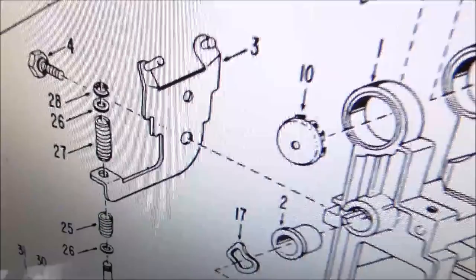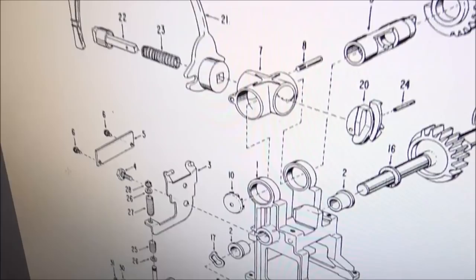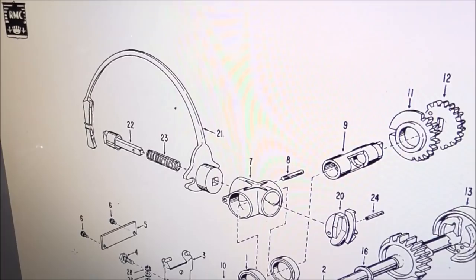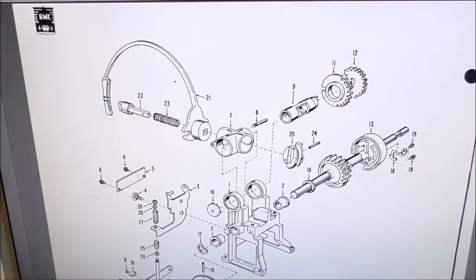It looked like more, but really, it's just the very top. Oh, and then we took the little housing here out. It's just the very top of it, just the gripper bow. You're not messing with the cam. The switches on the back of the cam go back here. You're not messing with any of that. You're not messing with any of this stuff here in the front. Just the gripper bow, because that's what gets gummed up. That's your problem. That needs to move precisely because of basically this piston going through it. That is the whole main problem, right? So we've got it all apart, and now we're going to slowly clean it and put it back together.